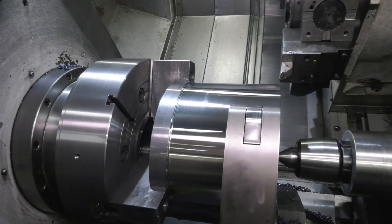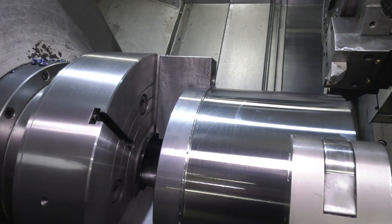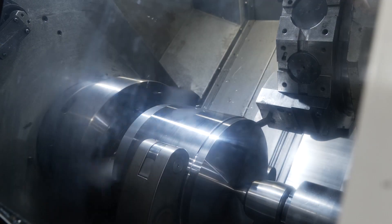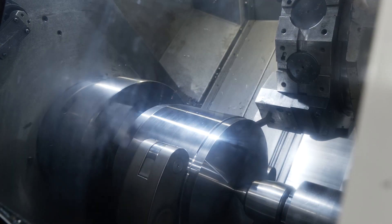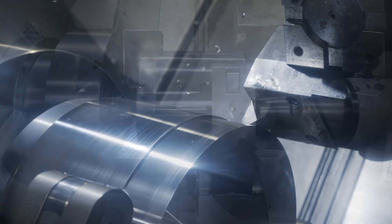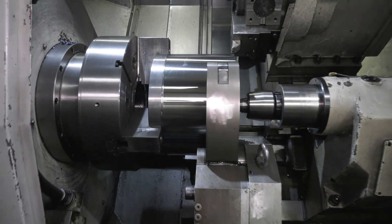The range goes from 160mm up to two meters, and you can have three or four jaw power chucks — standard or quick change jaw versions. They come with all the ancillaries, soft or hard jaws, and most importantly Bison make all of those connecting parts.